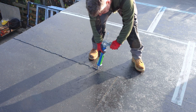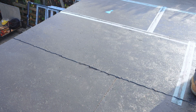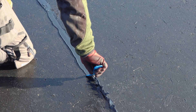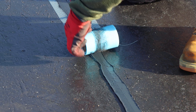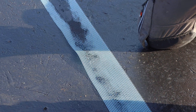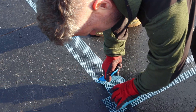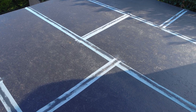Once the surface is dry enough to walk on, I can focus on the joints. I'm using Max Bond to start, spreading it across the joints and smoothing it out with a plastic scraper. Once all joints are filled, I roll out the reinforced tape directly across the Max Bond. Using my scraper, I flatten across the top of the scrim tape, and the Max Bond oozes through, grabbing and holding it tightly into position.